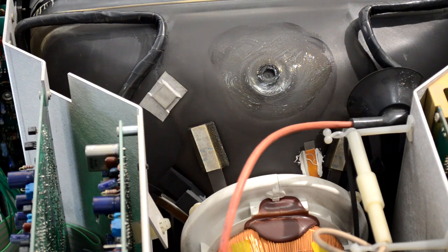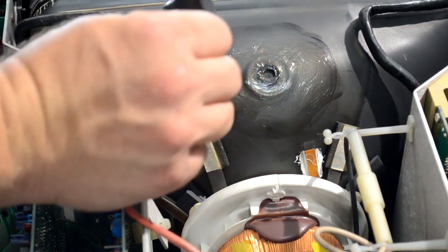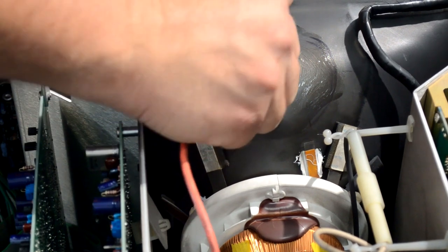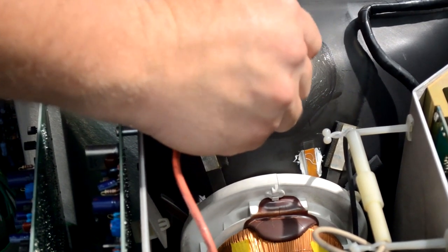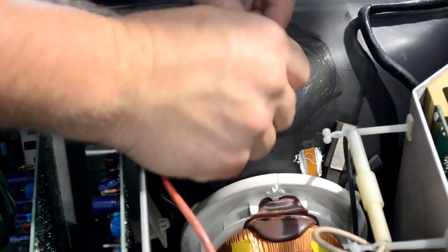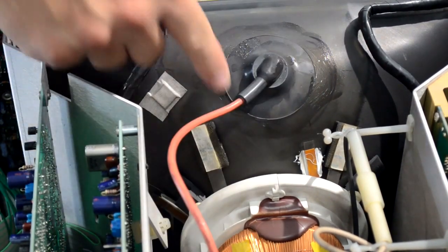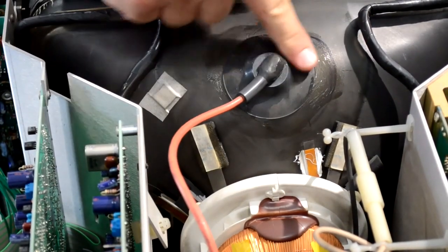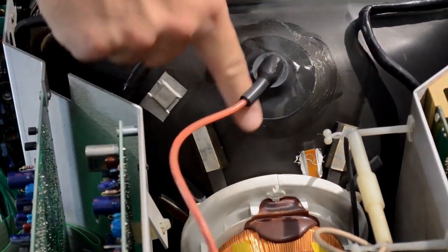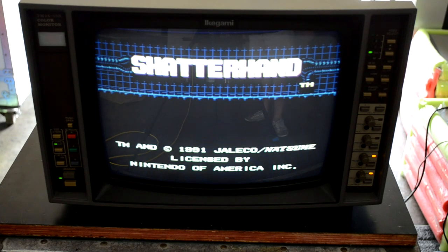Most of these flybacks are built with two different little prongs in the anode cap part. You push that together, then squeeze one side into the back of the tube, let them go, and they expand and set inside that little metal ring. That gives you your continuity but also holds it in place. Here we go — here's our test run after we've cleaned up and applied our new grease.